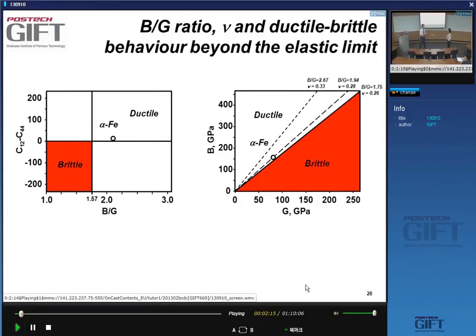So now you're going to try to do the same thing with this bar, and it's a lot harder. You can bend it, but it's just elastically, and here you're looking at something at 1500, so that's a 10 times difference, and you can really feel the difference. Even though it would be impossible to test it this way, it kind of gives you a good feeling.